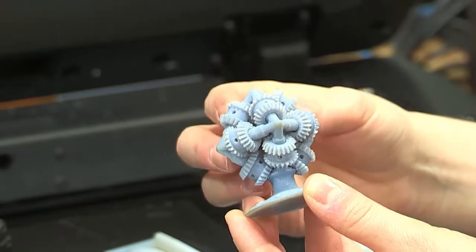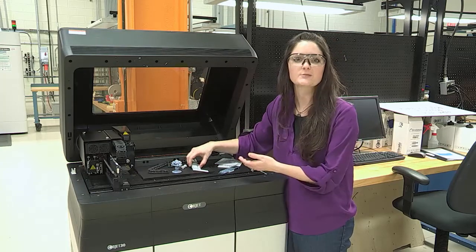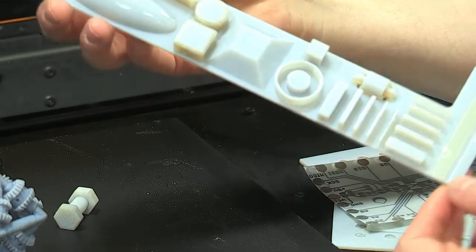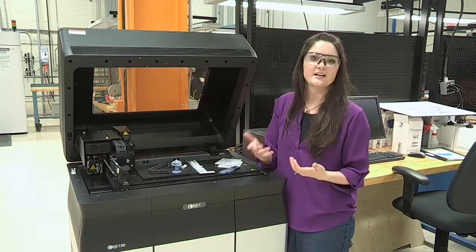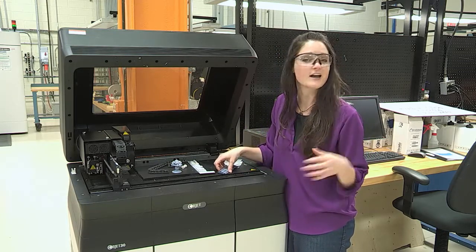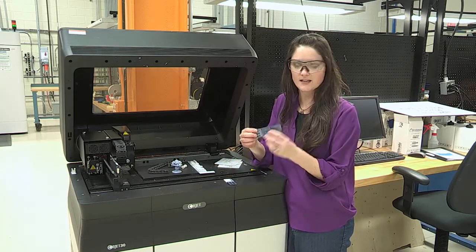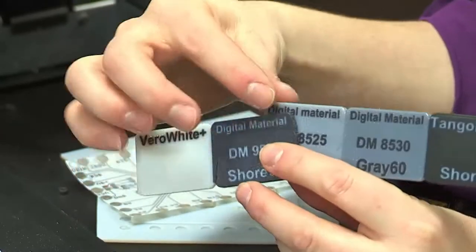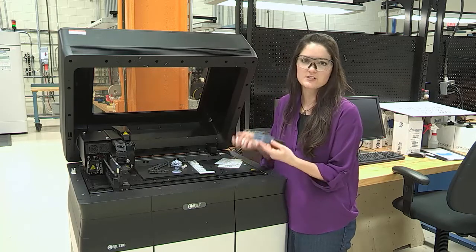The great thing about inkjet is that you get really, really high resolution — like 30 microns, 16 microns resolution. In fact, the layer resolution on this machine is 17 microns, so you can't really even see the layers anymore. Really high resolution, really great surface finish, really great feature sizes. Another great thing about inkjet is that you can do multiple materials — just like you can do multiple colors on your inkjet printer at home, you can do multiple materials here and mix them. We have this stiff white plastic and this rubbery black plastic, and we can mix them to get the shades of gray in between, so we can actually tailor the durometer of our parts throughout the part.